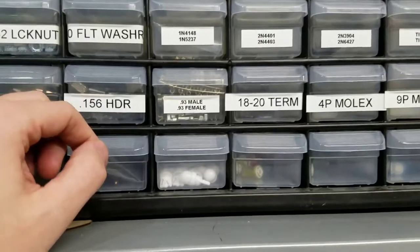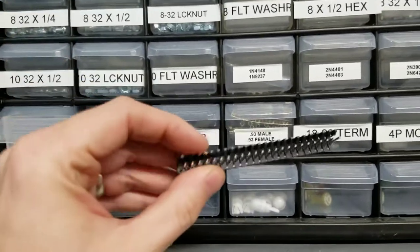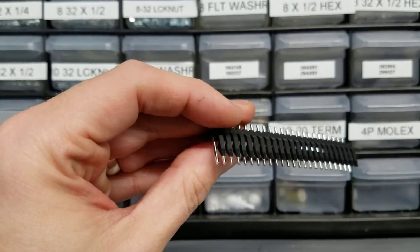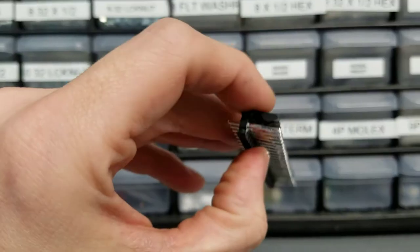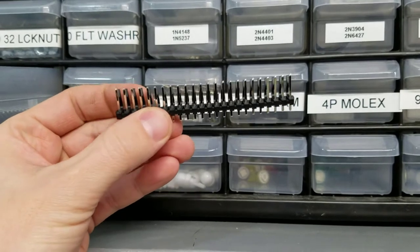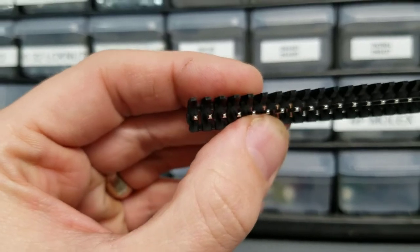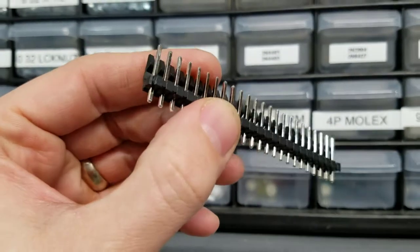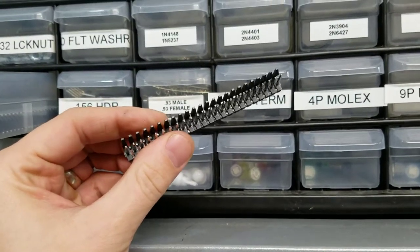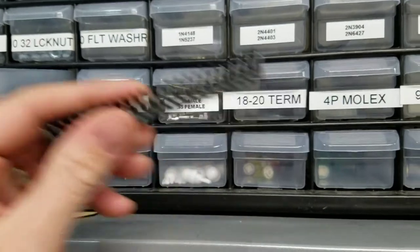At the bottom, you've got headers and Molex connectors. I buy these large sticks of pressure-fit Molex headers — the pressure gives you confidence you're making a good connection. The pins are square, not round, for a much tighter connection. You can buy them in long sticks and cut them down with snips. Don't just go out and buy the right size at Mouser or Great Plains Electronics — just buy the longer sticks and cut them down.